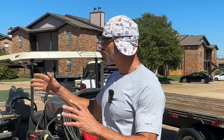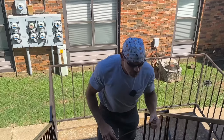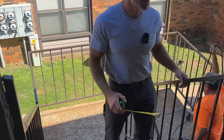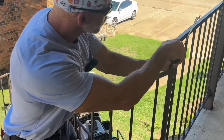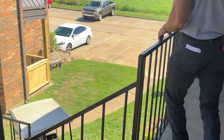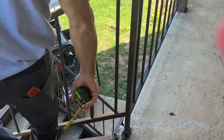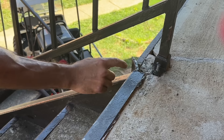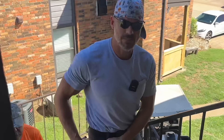So I'm going to take you with me and show you about how easy it is. Let's go, Jose. You got a driver's license? First building — you'll see these handrails are pretty old, but all they wanted to do was keep somebody from falling off. And if you jerk this over, it'll unplug out of that handrail and it's a hazard. What we're going to do is plug this back in. There's not a lot to weld to — we're making a silk purse out of a sow's ear, so to say. We're going to put a piece of square tubing from here to here, and that should be enough to secure it. If it's not, we'll do a little more.